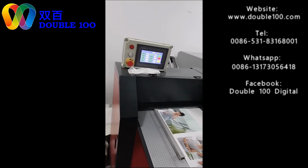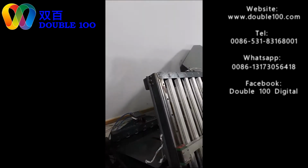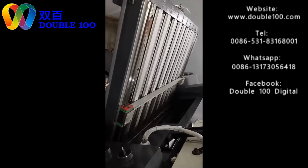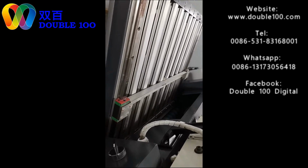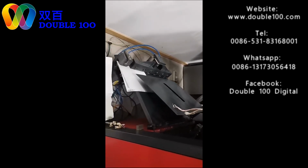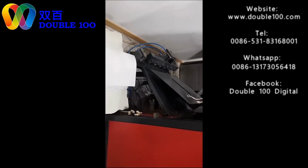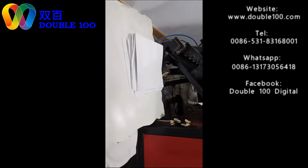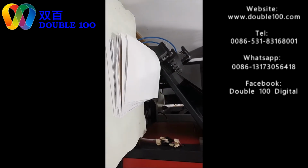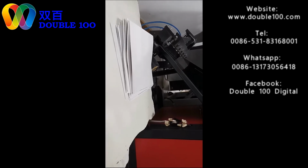We feed the paper, the machine will make the crease now, and it will make the folding. I show you here. Crease after crease, it will make the fold. You see the photo here. After the fold, it will press on the spines. With the spine pressing, the band will be very firm. It will be very easy for the next step, the binding.